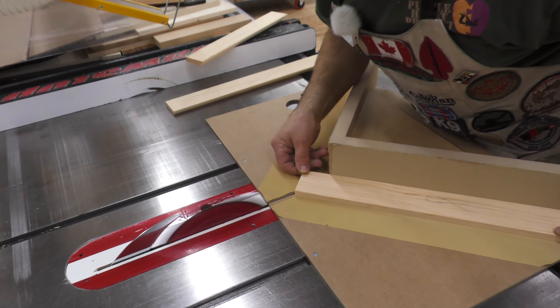Now to make this a little better, I'm going to put my sleeve on, and if you haven't got one of these and you'd like to make one, we'll leave a link below. If you have a Biesemeyer style fence, this is good for a couple of reasons. Number one, it acts as a sacrificial fence, which allows you to bring your blade into it without wrecking your good fence. But I use it because it gives me a lot more height, so I have a lot more reference surface.